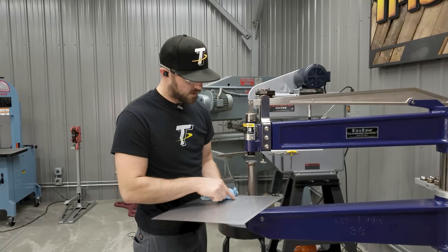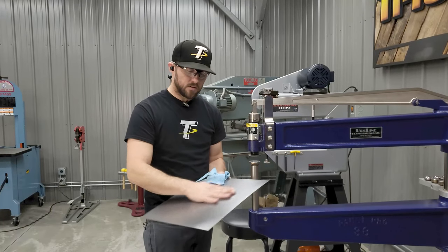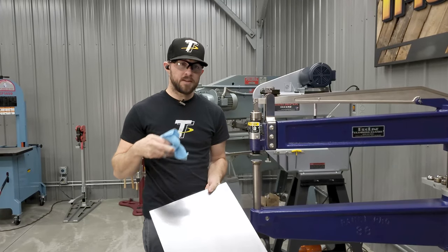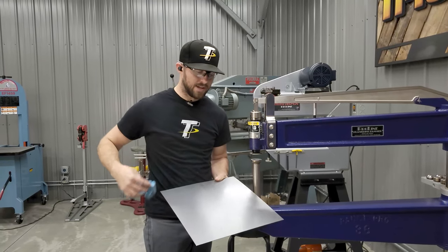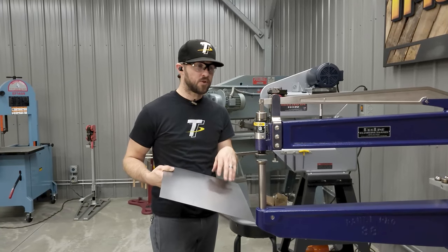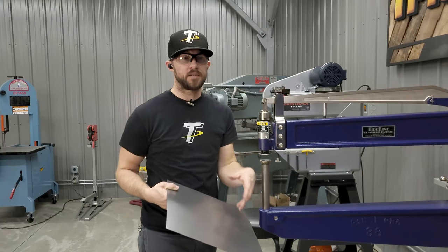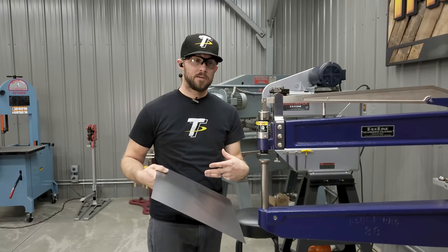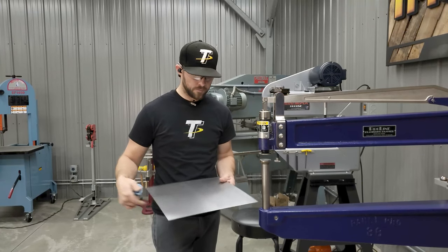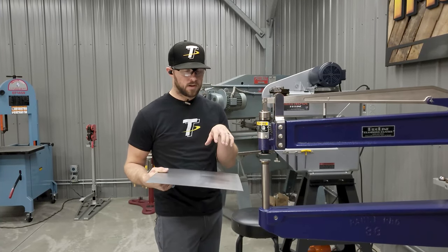You can see the tracking lines back and forth where I tracked, but there's not a whole lot of shape difference. That's why with metal shaping — same thing with an English wheel — patience is key. If you're trying to create a low crown, it's so easy to want to make it happen so fast that you go too far too fast, and then you've either got to try to take a little bit of crown out or maybe you've gone too far and have to start over.